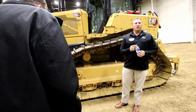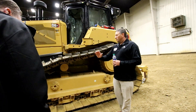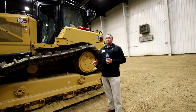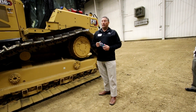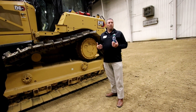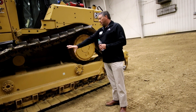With that roller further forward, you've got a gap in there, so we had to stick a couple more rollers in to fill the gap out. That pretty much took all of the vibration and resonance out of that undercarriage by putting that 10-roller system in there — really amazing. One of my favorite comments is from our expert operator Bob, and he'll say it doesn't kick you in the kidneys anymore. It's nice and smooth all day long — you don't feel like you're worn out.